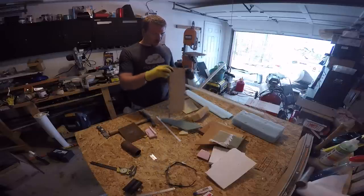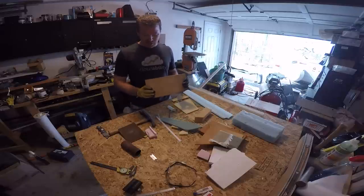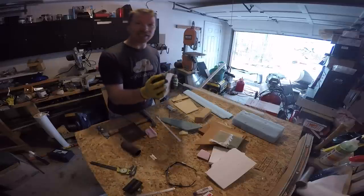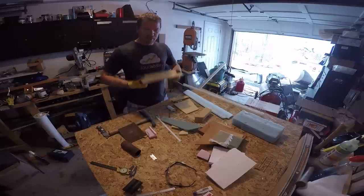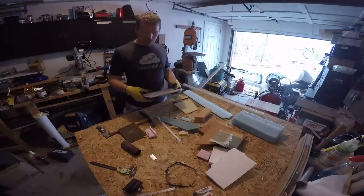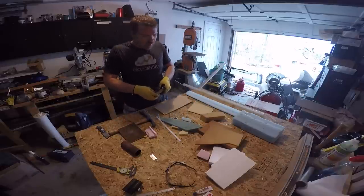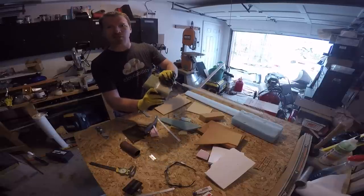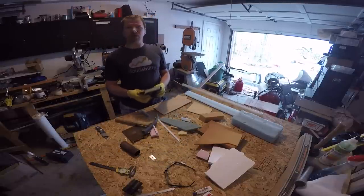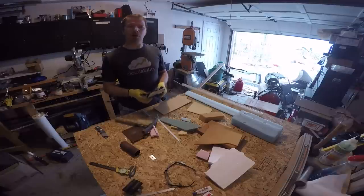For those wondering — yes, I do use wood, and it gets embedded straight in the fiberglass. The reason for wood is this marine-grade plywood — I think this is 14-layer in a single quarter-inch piece. It's extremely dense with zero voids, and this is what you use when you want hard points. This or aluminum — I use a lot of aluminum or steel. So if you're running a bolt through something this provides good crush resistance. I can't push this with my fingers and I barely marked the surface with that hammer — it's still smooth.